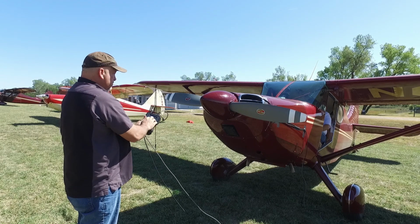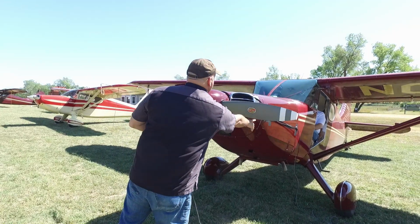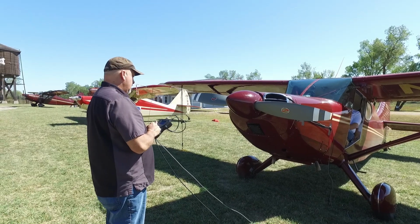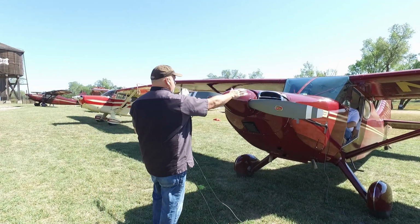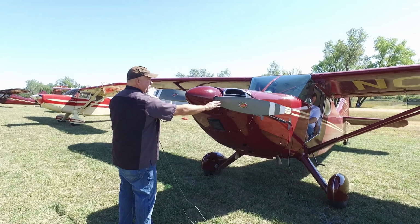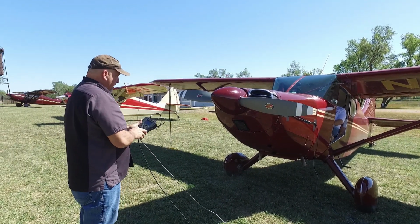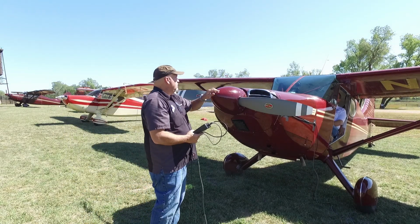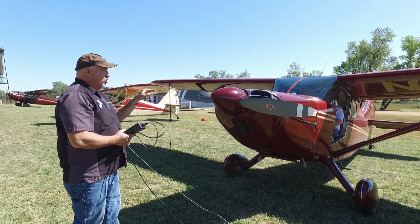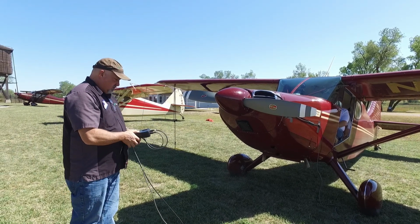It's a two-bladed propeller, so you tell it it's got two blades. The photo tach is on the right side. You see the photo tach here, and while I'm looking at it, it graphically shows me the photo tach on the right. I put in 12 holes. There are 10 screws around the outside, obviously missing where the blades are, but there are 12 holes essentially symmetrically around the spinner. And then I told it that when it's in this position, the one on top is number 1. So it's going to let me know exactly which screw to put it under. I want to have that consistent numbering scheme. So I've got all that in.